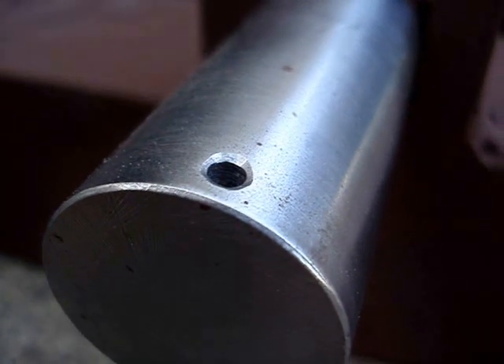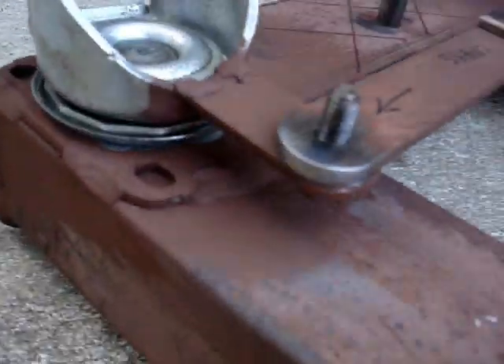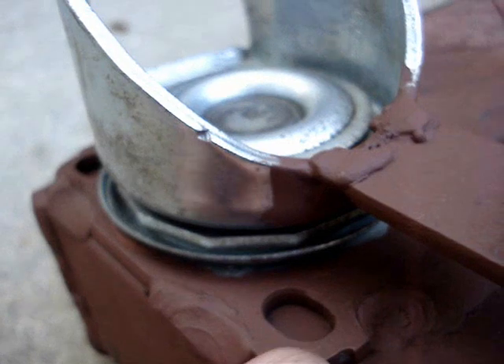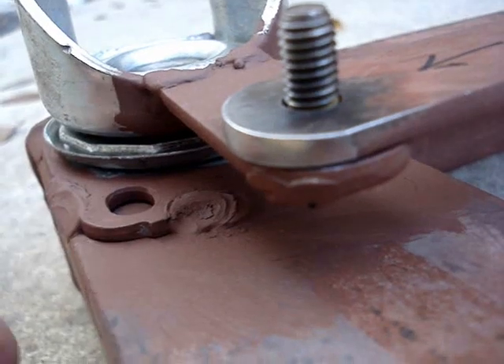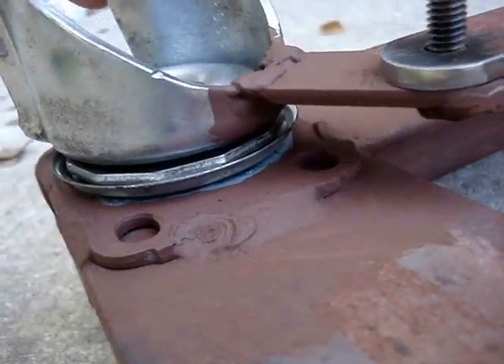Here's a close-up of the ends of the shaft. I've already dropped the dip pack back down into the dolly, so I know the bolt holes are going to align. I welded the casters down — probably not the most clever idea, but I did it anyway. I could have drilled and tapped the holes, but that would have meant cutting the bolts really short inside the dolly and I wouldn't have gotten that last 1/16 of an inch I really wanted. So I welded the casters down.